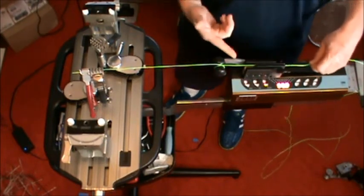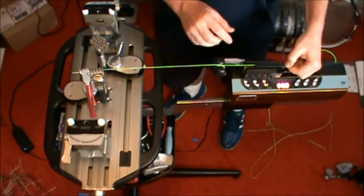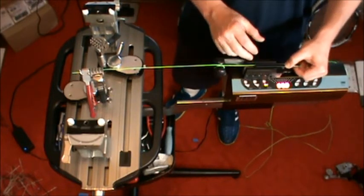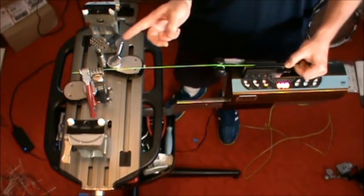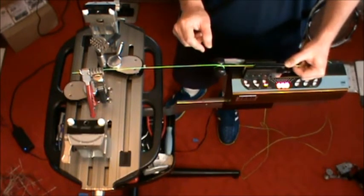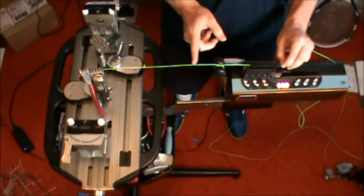But if I turn the constant pull feature off, which puts it back into a lockout mode, which is exactly like a crank machine, once this hits 55 pounds, you're going to see this number just plummet. So that advice I just gave you a moment ago about if you're using a crank machine and you pull tension, you want to swiftly move your clamps, even more so when you're stringing polyester, because the tension drops on it even faster. So you'll see it hit 55 pounds, but then the numbers will immediately start to plummet with the polyester.